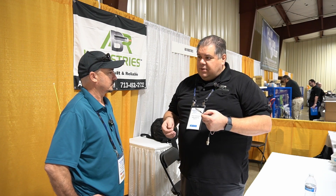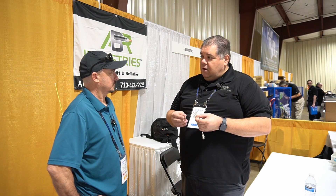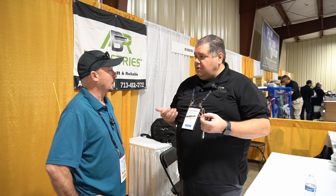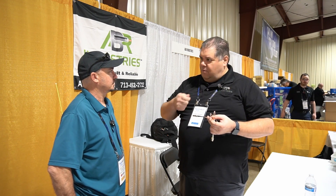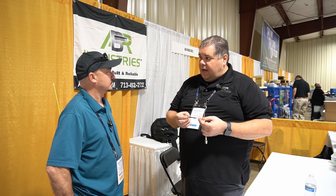The nice thing about this is it can cover everything from the lightweight cables, like the 316 product that we have here, going all the way up to our POTO cables, which is the 240 Ultra Flex. So we can do these all the way up on 240? Correct. You can change these all the way up to the larger cables. You can do a fixed PL on one side, whatever you know is a fixed connector, or you can do FMEs on both sides.